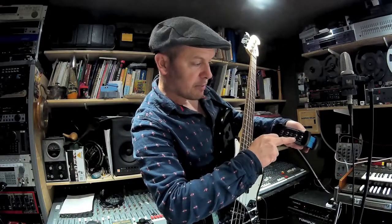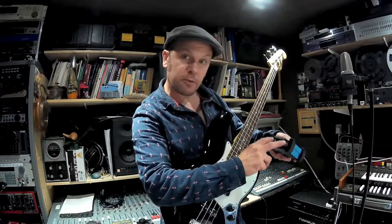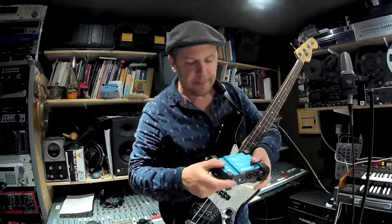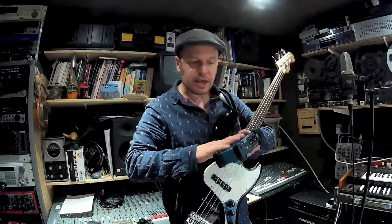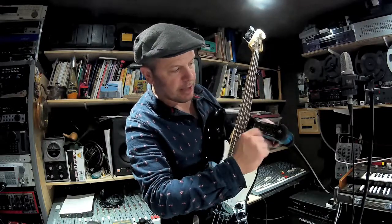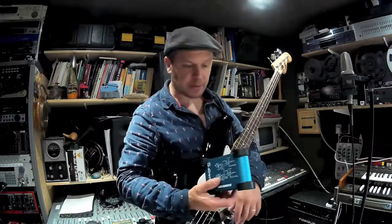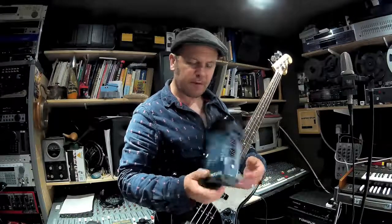You also have stereo models which are great for keyboard players — you have a left and a right for digital piano players. You plug your left and right inputs in, and then you have two link outputs so if you've got two amplifiers on stage you can listen to your own piano through those. The XLRs on the other side go to your mixing desk. This one also has a ground lift and electronics which require power — most DI boxes with internal electronics are active, meaning they need power. They don't amplify very much, they just reinforce the signal for a really clean output. This one can be powered by either a nine-volt battery or by phantom power from your mixing desk, which is 48-volt power that goes down your mic cables.